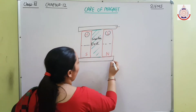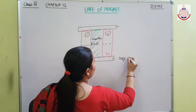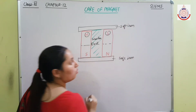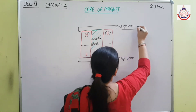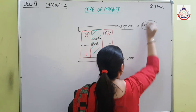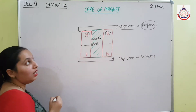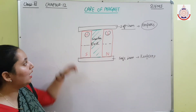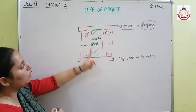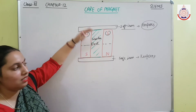Keep in mind: if this side is north, this side should be south; if this side is south, it should be north. We have to pack it this way. On the ends of the two bar magnets, soft iron pieces are used. These soft iron pieces are known as keepers. So this is how we store the magnet — unlike poles on the same side, a wooden block in between, and soft iron keepers at the ends.